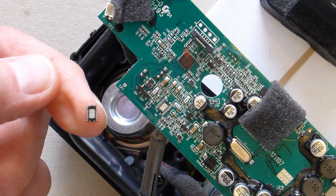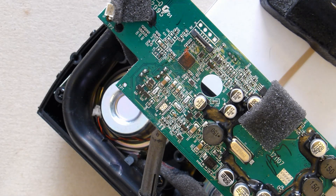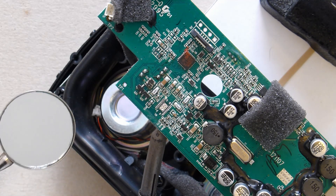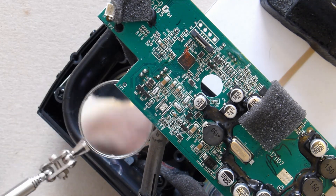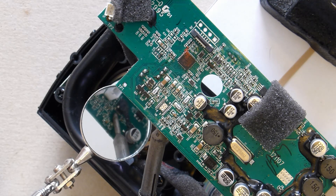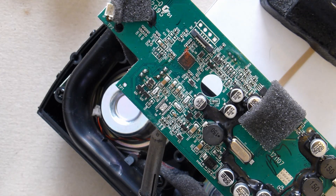There's a fair bit of solder left on the board so it won't need much for the new chip, but I want to first level the solder that's there. The technique I'm going to use is having a hot air gun applying heat from the top and a soldering iron to apply heat from the bottom. The iron's set to just over 200 degrees centigrade, so it's just about melting the solder to produce the basic level of heat, and then we'll do the rest with the heat gun.